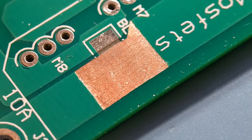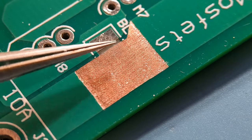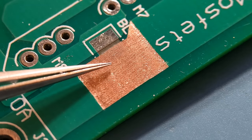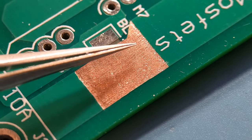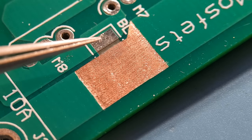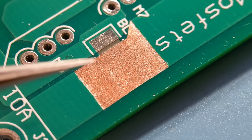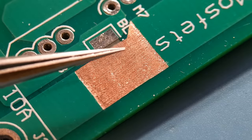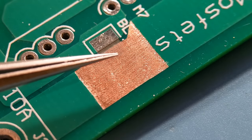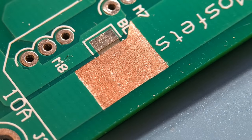Following on from the short resistor demo, we've come to this second demonstration. I've removed the resist on this large trace — there's normally a pad here with resist around it. This is simply a blob joint from trace to trace. If I try to do that now, you're going to get solder flowing into a very wide area. And if you've got RF boards, you really don't want solder going to points where it's unwanted. So this is a great method to control your solder flow. I'll quickly Kapton up around this area, leaving this small area exposed, then solder it up and see the result.